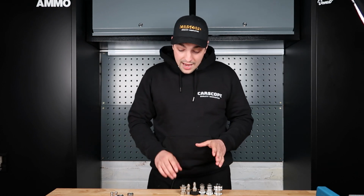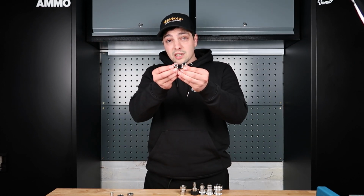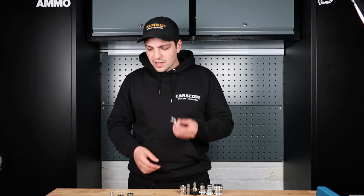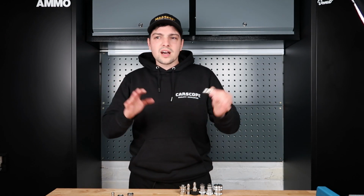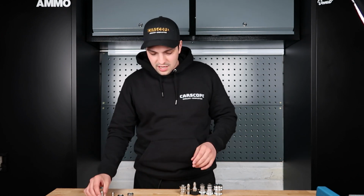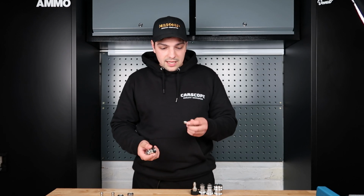So moving on to 3/8. It's just a little bit larger than the 1/4 inch, so a little bit more flow. It's usually used for the inlet to guns, outlets from pressure washers and that type of thing, whereas the 1/4 inch is usually on the outlet of a gun or on a foam can. You can kind of break it up that way and it makes it a little bit easier. So if you think outlet 1/4 inch, inlet is 3/8. It's not always that way, but it's an easy way to think about it.